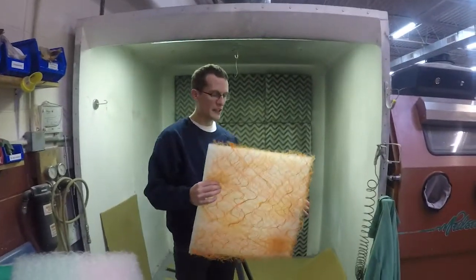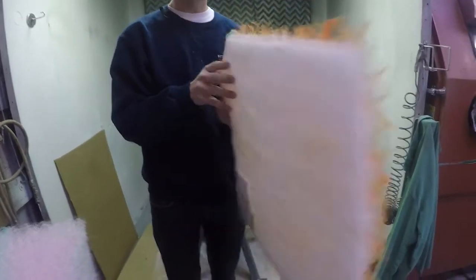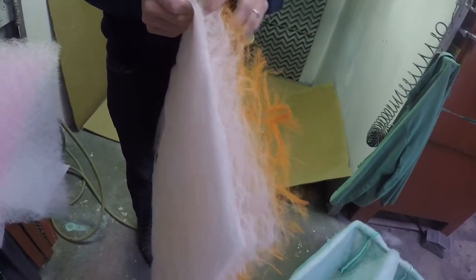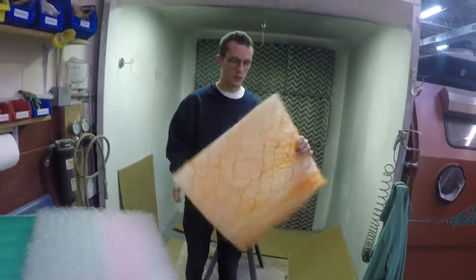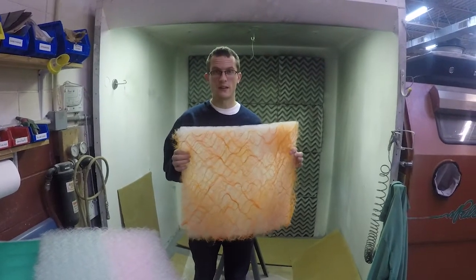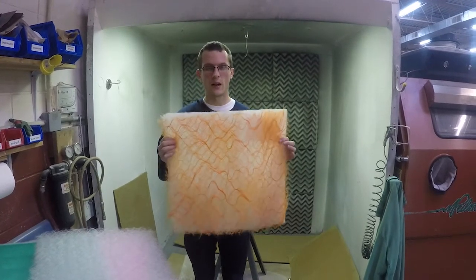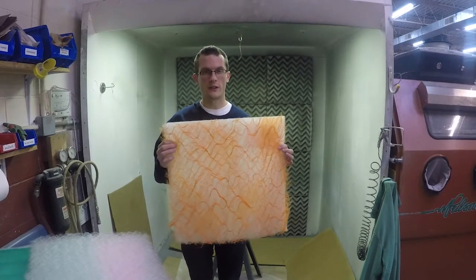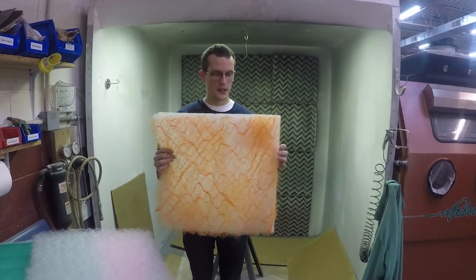And then this would be called an E28 style filter. It's 3 inches thick. You can see the backing is a lot more substantial, and then there's an intermediate layer between the top and the backing itself. So what that provides for you is kind of your ultimate as far as overspray capture and longevity of use. That being said, they are a little bit more of an initial expense for an E28 filter. They can be a great option for your only single stage filter option. These are the 22 gram, would be the first choice for most single stage options.